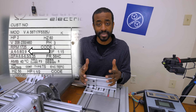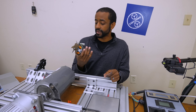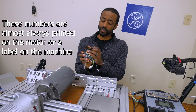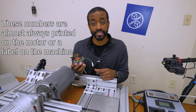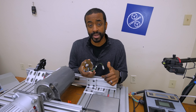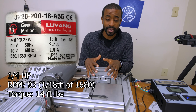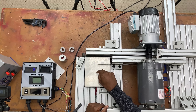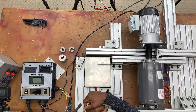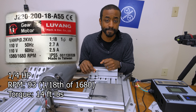But many motors cannot go even a tiny bit over their rated horsepower for any amount of time. That's why it's important that you test it at its rated current, as I just did. Most of the time you're going to be testing an unknown motor, but almost always there's a label — like if you look at the motor we were talking about before, it's got a rated current of 1.45 at 115 volts. So now I know how much power I should be drawing from the wall when the motor is putting out its rated horsepower. Now we're testing the other extremes of this rig — I'm going to be putting a lot more force on the scale. This is a geared motor; at 18 to 1, it's going to produce a lot more torque. The label says it's 0.2 kilowatts, so we're going to be measuring that here with the rig.